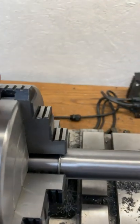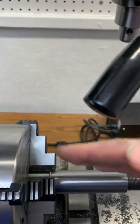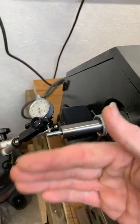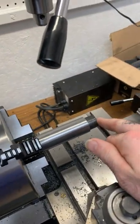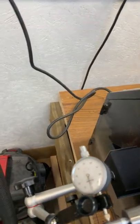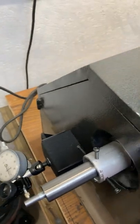But there's a trick for that. If you see this wire in between here, that allows the barrel to pivot in the jaw. I come back here and I've got the spider assembly that I made, which allows me to adjust the barrel out at the far end. I put an indicating pin in here as well, put an indicator on it, and get them both zeroed. Then I know the total runout over the whole length of the barrel — usually in tenths, so if you split one thousandth of an inch into ten parts, however many of those is the total runout of the whole barrel.